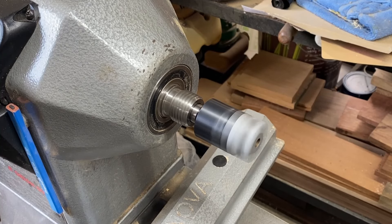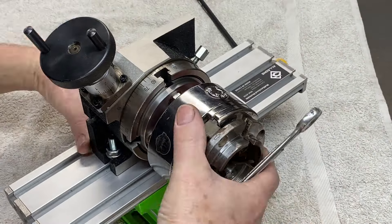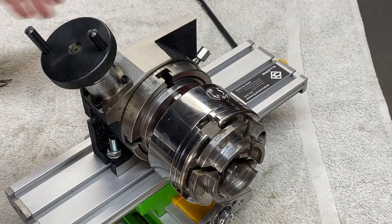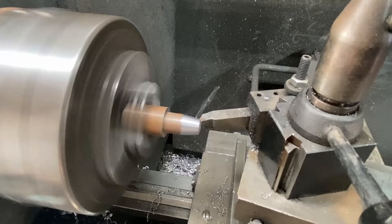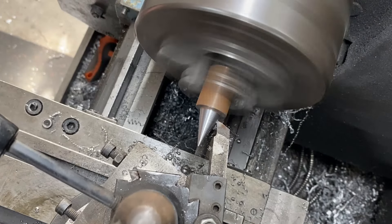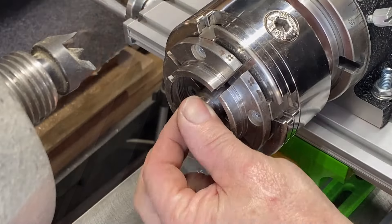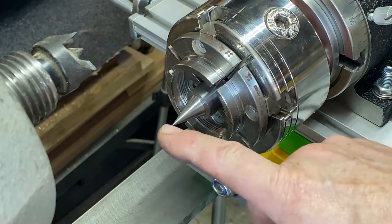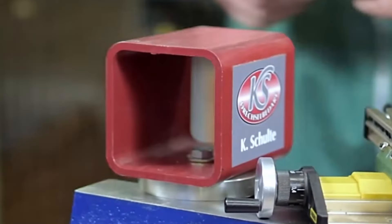I'm winding this up to 5000 RPM. The rotary table is then bolted onto the cross slide and I've made sure it's parallel at the back. I need to get the centre height sorted out, so I'm making a tapered piece I can hold in the chuck and bring up with one in the headstock of the lathe. This will tell me what height base I need to make. I've packed it up with some wood and steel, and now I know the thickness of the base that I need. The JaHo tool used a piece of tubing, but I didn't have anything big enough so I had to think about making a custom base.